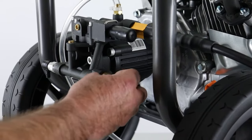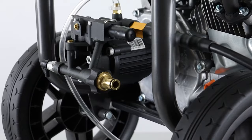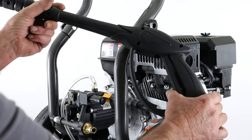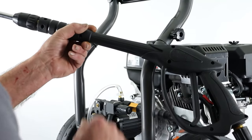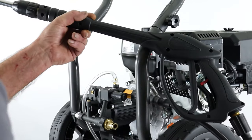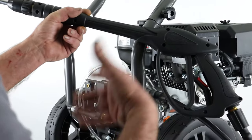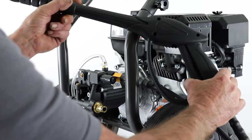We would connect our hose pipe from the mains water and turn on the tap. Water would come to the pump first of all. Then, without the engine running, we would pull the trigger. Water will gradually work its way through all the hoses and out through the tip in the end of the lance and you will hear the bubbles and air coming out. There's a little safety red tab on this trigger so that if you leave the lance unattended it's child-safe and you can't inadvertently pull the trigger. That red tag is a safety lock — open and close. Once water is flowing through because you're pulling the trigger and water is coming out of the end of the lance, this is the point where you can pull the recoil.